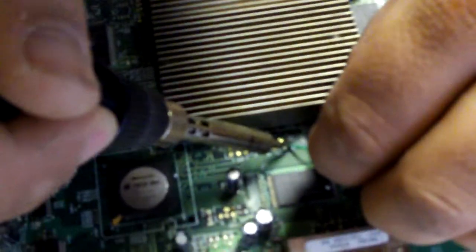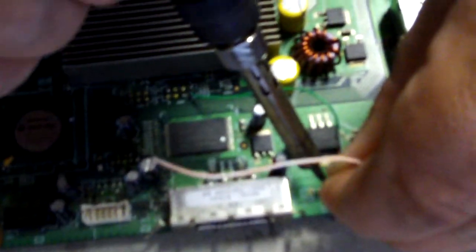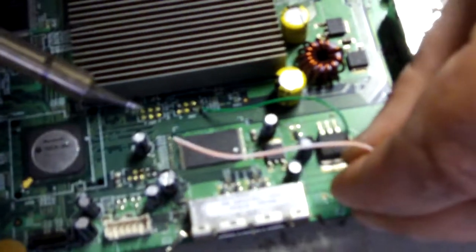I'm not 100% sure yet. Another thing on these wires — it's going to make it a lot easier if you tin your points first. It's going to make them stick a lot easier. I'm using cut-up landline wire.